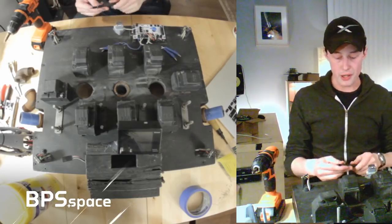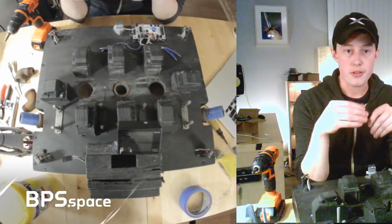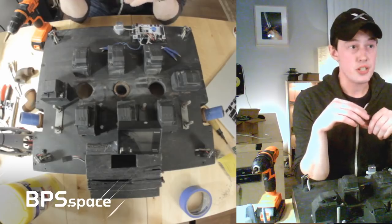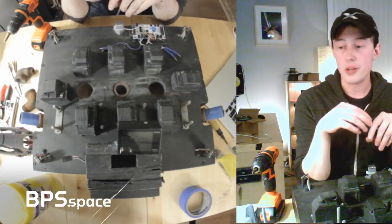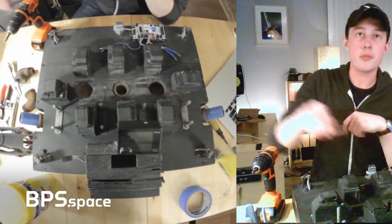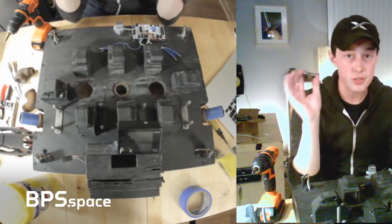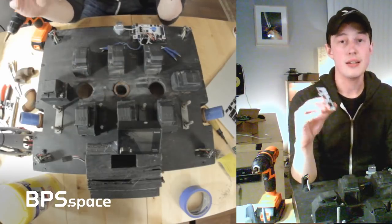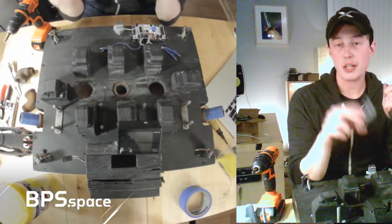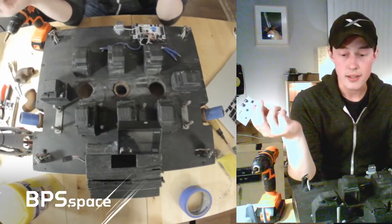So what you're measuring with a barometer, or at least a barometric altimeter, is the air pressure. And there are a couple of problems with measuring just air pressure to determine altitude. One of them is just noise. If the computer is on the ground and then moves 1 meter up, that change in air pressure is so tiny. It's very hard for the altimeter to sense that. But if you have good filtering between your accelerometers and your barometric altimeter, you can get pretty accurate data.